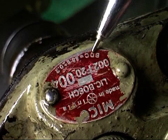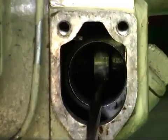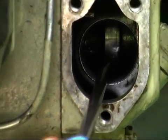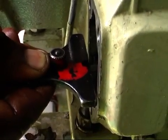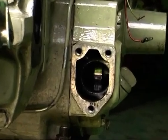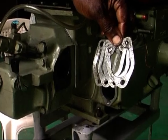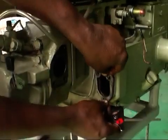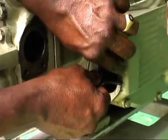Second, an alternate procedure for adjusting pump timing with the help of a depth gauge. Take the bottom dead center depth limit of the pump manufacturer and measure it from the gear case to the camshaft BDC point. If required, add or remove the adjusting shims for exact depth.